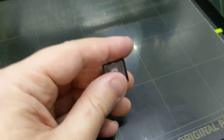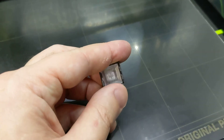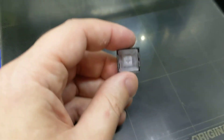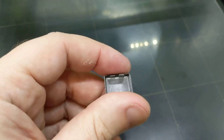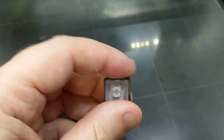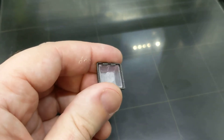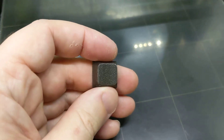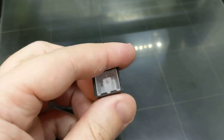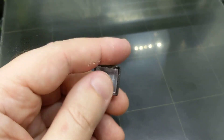I also added Alps stem support. Alps stems are pretty small and thin — I haven't had one break yet, but it seems possible because of just how thin they are. As long as you print it on its side it should be nice and strong. And it's not a big deal if it breaks — you can just snap it out, get some tweezers, print a new stem and pop it in. So there you have it: the new snap fit stem support lets you get transparent legends without a multi-material printer.